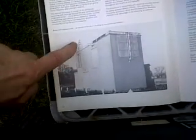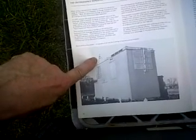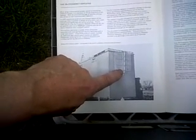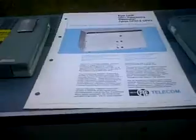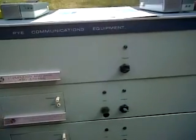The way it achieves this is by the use of two aerials — one at the front of the building, usually a co-linear, a 12-element beam; and one at the rear of the building on the hilltop side, which is a four-stack SA-460 antenna made by Python Glass. There is a shot, a picture of a Pi OFR on site, with the duplex aerials going up — one to the go and one to the receive. There is an RF amplifier of 5 watts in the duplexer chassis.